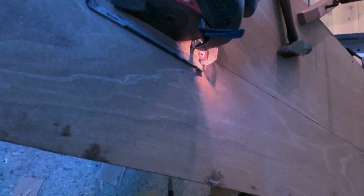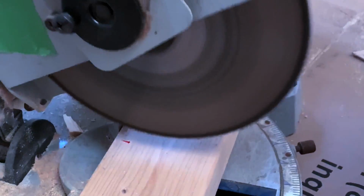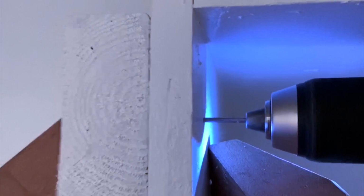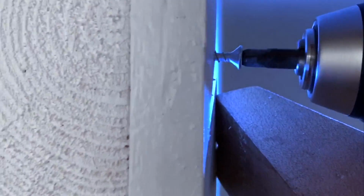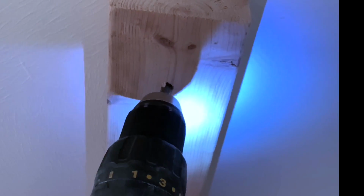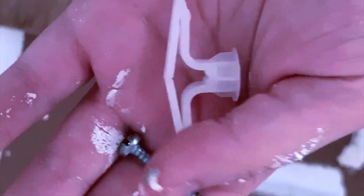All we had to do was just get some 2x4s, and we secured that to the wall in the back and also to the shelving units on the side, and to do that we used some heavy-duty glue and also drilled into it. We used those same 2x4s in the front of everything to cover up those blocks and to give it a more polished and thick look at the end. We also used those same 2x4s and attached them to the ceiling with some heavy-duty anchors so that we could put some molding on the ceiling and attach it to that.